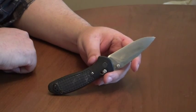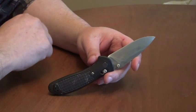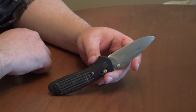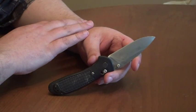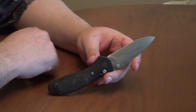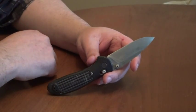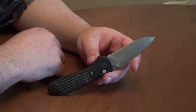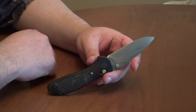The original owner sent it to me, very frustrated with Benchmade. The original knife had the problems, and the replacement — this knife — had the problems. When I got it, I sharpened it a couple of times, exactly as he said: nearly impossible to sharpen, just wouldn't get sharp. I looked at it under magnification and could clearly see that the edge was actually fracturing under the stones — it was just breaking apart. So the edge wouldn't even form, and as soon as you tried to use it, it would just be obliterated. No edge retention.